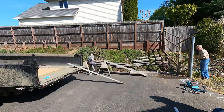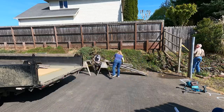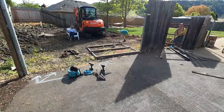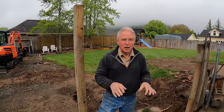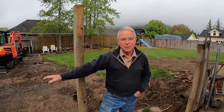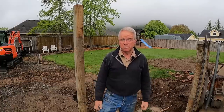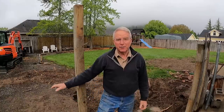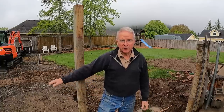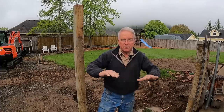It's time to really start in on the Brewster shop. We've got the fence boards torn down. We've salvaged what we could salvage and thrown away what had to go. So this morning we're going to be carefully easing into uncovering some utilities that are right here. This was an RV parking space that was put in apparently when the house was built, about 20 years ago. There's a couple pieces of good news. The first being that there's a lot of base, a lot of big rock underneath the grade here on this parking space, which means I don't have to do a great deal of site prep before we build up and get ready to pour the slab.